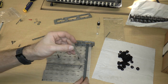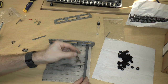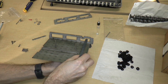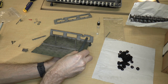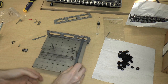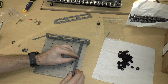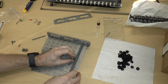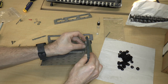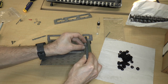And the reason for that is that the key stems have these funny little cutouts over here. And when the cutouts are, I think I would have to put this stem through one of the holes. Let me do that. Like that. Okay. So you can see that if I push the key down now, it's kind of hard to see, but if I push the key down, that will rotate the bar, and then the bar will snap back into place due to the action of the spring. And then this is now pressed down in place.